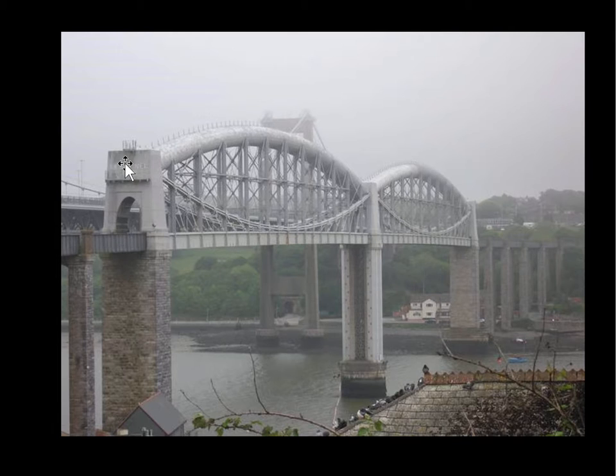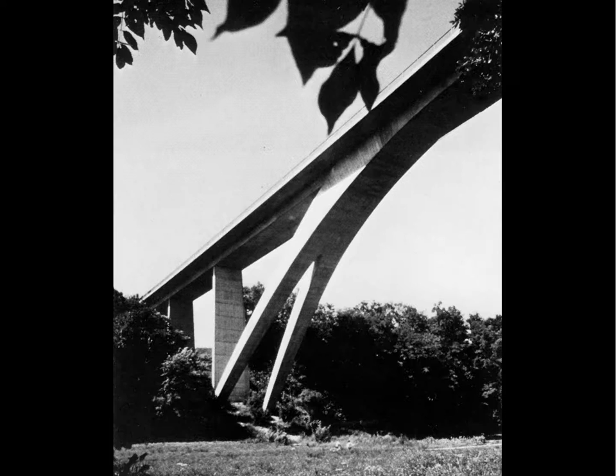This structure is splayed apart to give it a strong base. As we move toward the base, we don't need all that width to handle compressive forces, but we need it to resist being blown over by wind forces or seismic effects. So at some point the arch splits into two legs that provide a broader, more stable base.